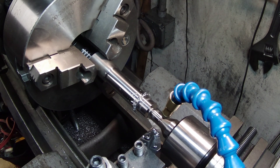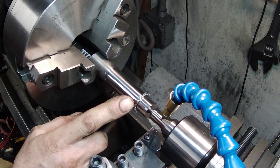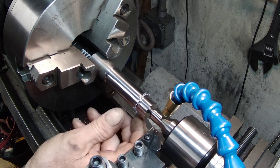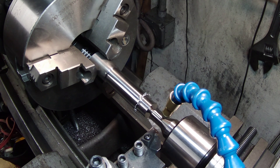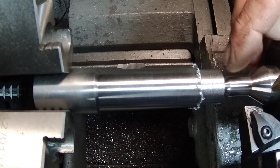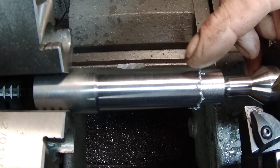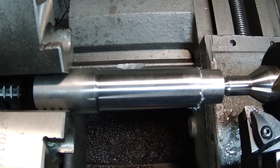I see a jagged edge there. Let's take a look at what we got. I'm not going for finish here — we're just roughing — but that is a pretty gnarly looking edge. It would break right off, but that's just something I see. Here's a quick close-up of the WNMG insert. Not a terrible finish, totally fine for roughing, but you do see this kind of rolled-over edge here. I could knock it off with my finger. Let's see how the next one does.